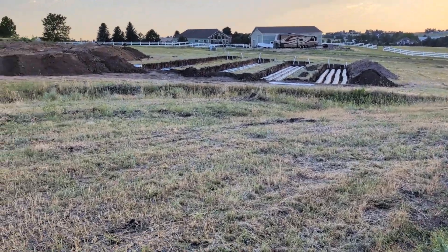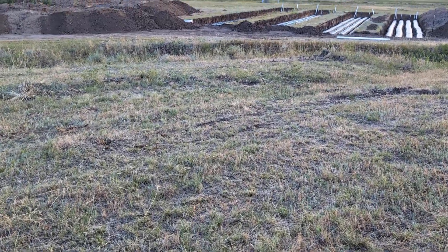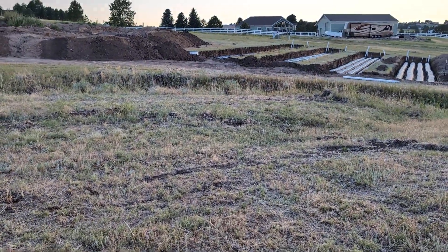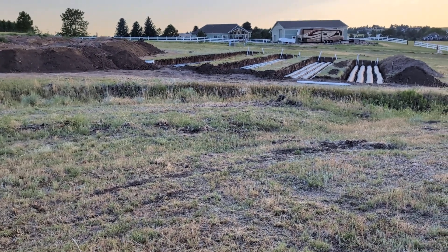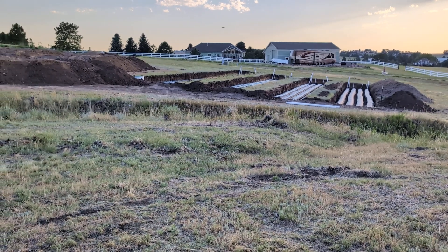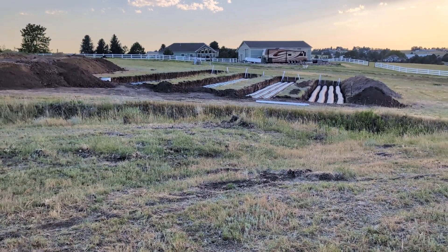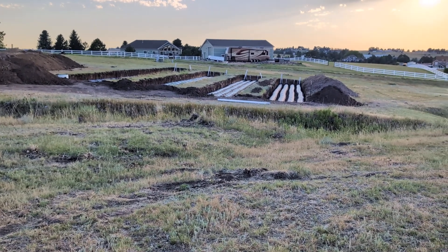On this side of the dry gulch will be a standard 2000-gallon two-chamber septic tank, followed by a dosing tank. The dosing tank is 540 gallons and has a submerged pump with floats — every time it hits the upper float it turns the pump on. It's a 70-gallon-per-minute pump that should run two to three minutes per dose, flooding one of the beds. We'll go take a closer look at the manifolds.